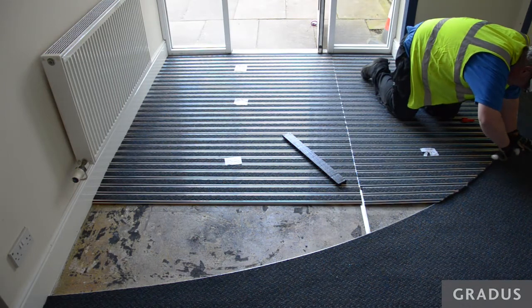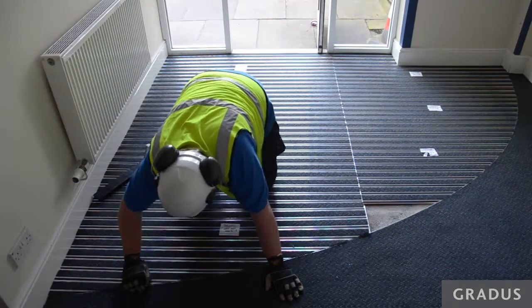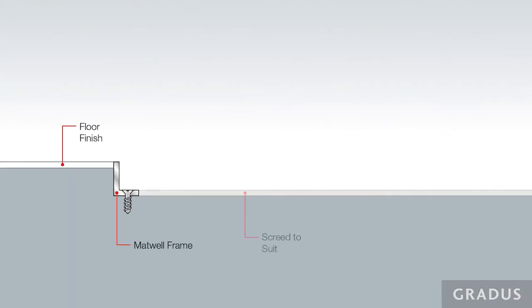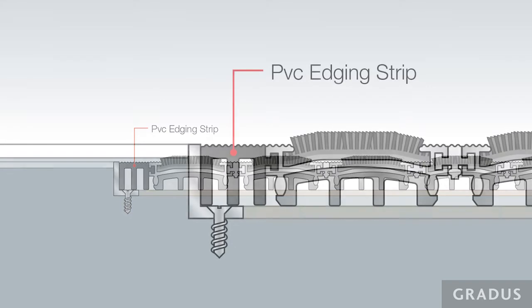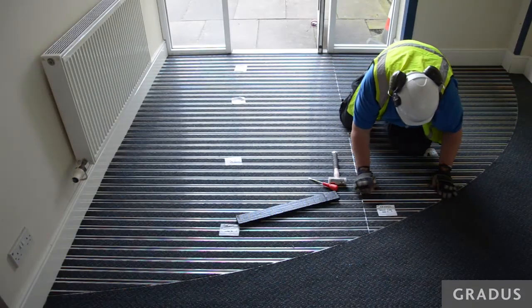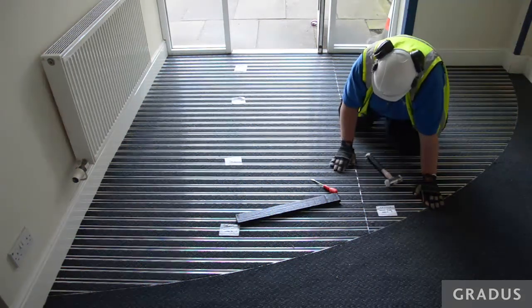Ensure that the mat will fit in the matwell in the correct direction. Check the front-to-back clearance in the direction of traffic, and where PVC edging strips are included — 20mm or 40mm — ensure that they are fitted along the front and back edges. The PVC edging strips have a T-shaped connector that should slip into the aluminium channel edge of the matting panel, which will lock this into position prior to any site trimmings of the profile. These edging strips should be installed in conjunction with the first and last panels.